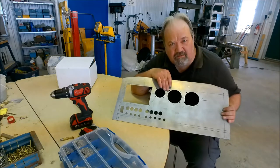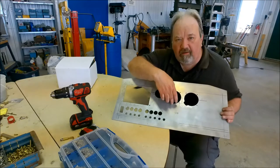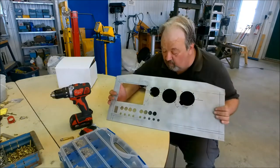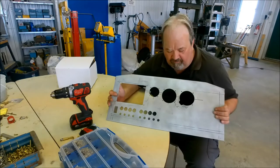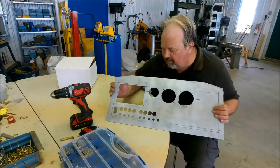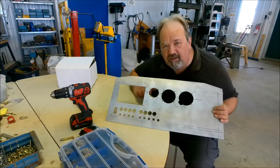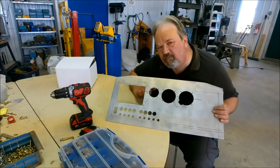For the airspeed and altimeter, we can get those rings that have little nuts on them to put in behind if we want. But if we're going to be removing those devices — the airspeed and altimeter — we're probably going to take the whole panel down as well, which means we've got to disconnect the pitot-static lines. So right now I'm going to drill and mount these nut plates, and I'll see if I can get you guys nice close-up shots of what I'm doing.